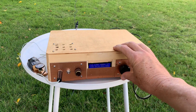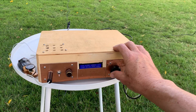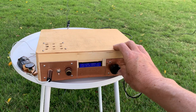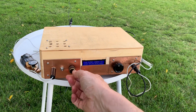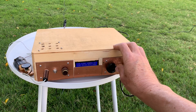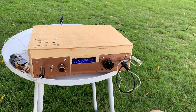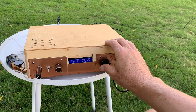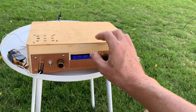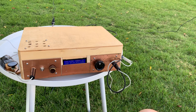Let's tune around CW a little bit more here. Like I said, it was fun — I worked GM4ATA this morning. The filter helps me tune in better. Without the filter, it's tunable over a really broad range and you can't really be sure if you're getting close to 600 hertz. Now you know you're pretty much on 600 hertz, so you'll be on the same spot when you transmit — you'll be in the pass band.